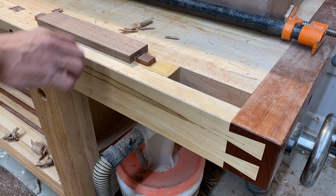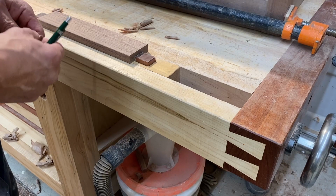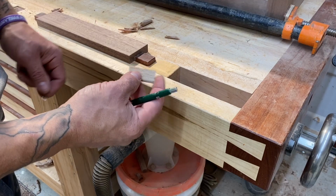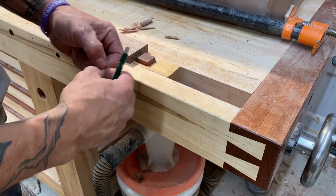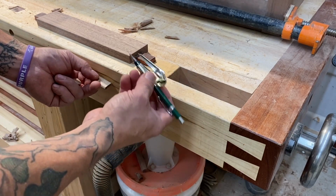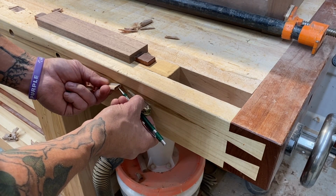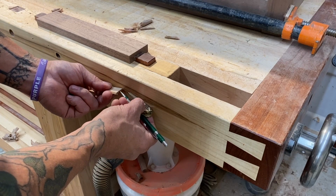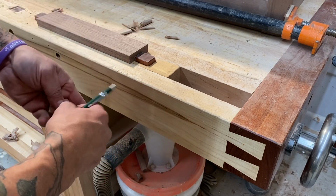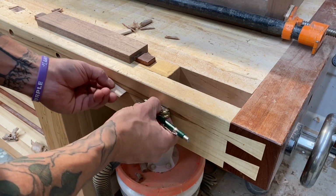So I'm in the process of laying out some dominoes for these supports for a project that I'm working on, and I find it very helpful to take a domino and put a center line down it. And the way I do it is I just use a scribe. These are typically used for scribing countertops or trim to a crooked wall cabinet pieces. And so I just center it by rotating that back and forth. And then I can just easily mark those dominoes, right? Something like that.